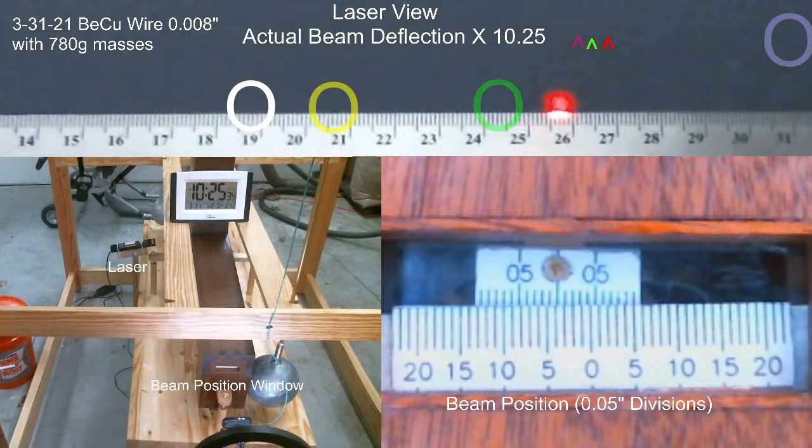Now, pay attention, Riley, you nitwit. If this thing goes back up to, let's say, 260, it went down to 110, and we just take the arithmetic average. For you, Riley, that means adding the two numbers together and dividing by 2. The center point would be around 185. But that's not going to be a good true indication of where the center point of this oscillation is. It's really quite a bit lower than that. I forced it into an extreme oscillation by doing what I did.